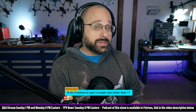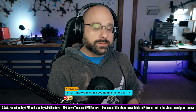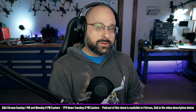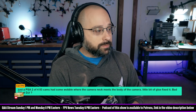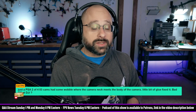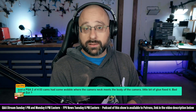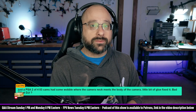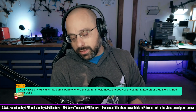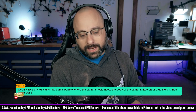I've done enough motor testing and talked to guys like Ryan Harrell who do a lot of it. If you get a motor stamped 2400 KV and it reads 2380 or 2430 — within about a plus or minus 50 KV range — that's completely normal. And when you see motors stamped with something like 2379 KV, that is complete bullshit. The manufacturing is not precise enough to guarantee exactly that KV. When they say 2400 KV you could say they're just rounding, but anybody who markets a motor with a ridiculously specific KV — it's marketing bullshit. It doesn't mean anything.